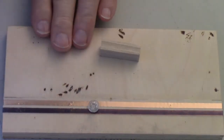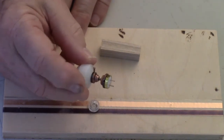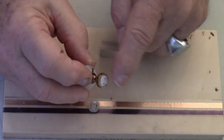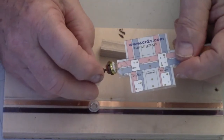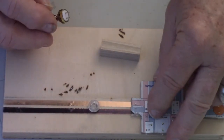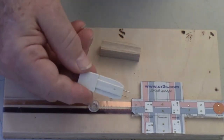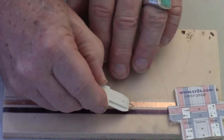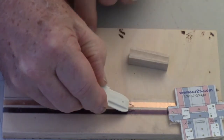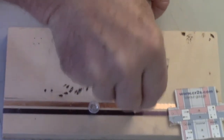For putting the chandelier adapters in, which is the one that we did on this schoolhouse lamp, we have just these little pins here, and that's the connection at this end of the gauge. We can line that up onto the flat tape, or we can use the 12-volt tester, which has the same dimensions, line it up so that it touches the two areas on the flat tape, go down here and make our mark.